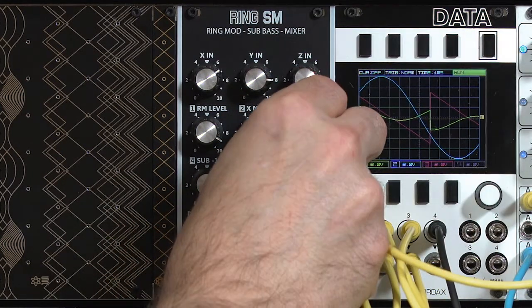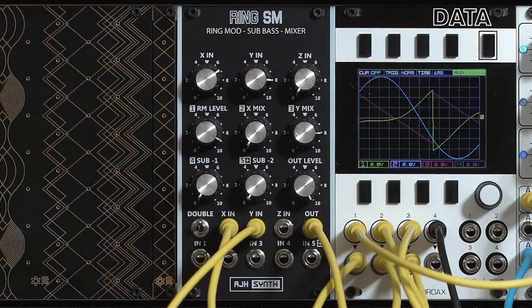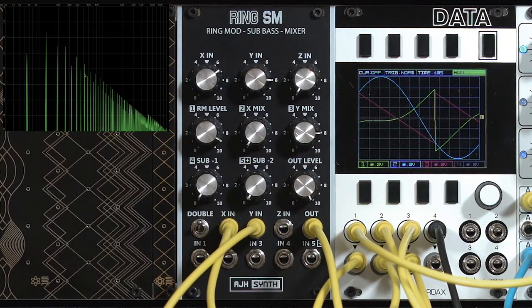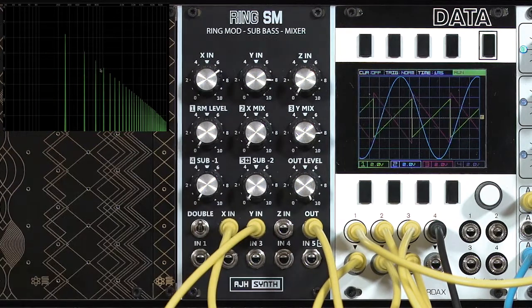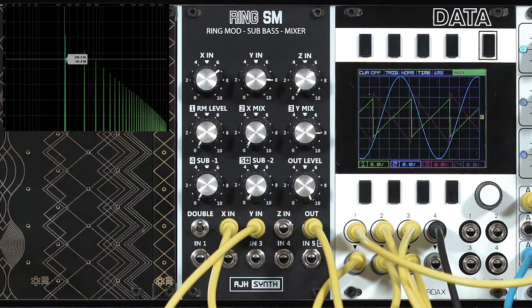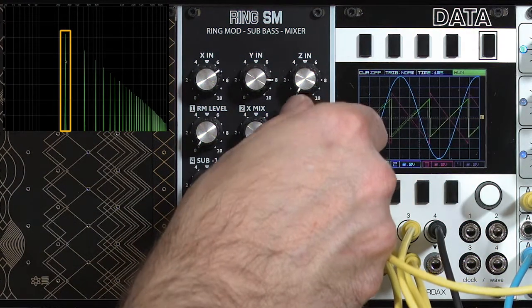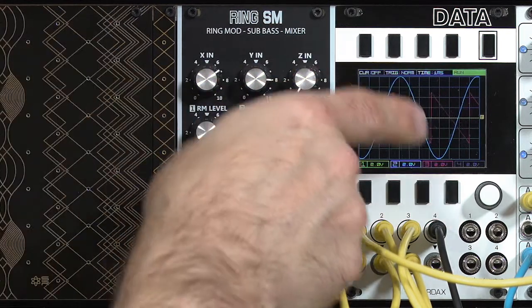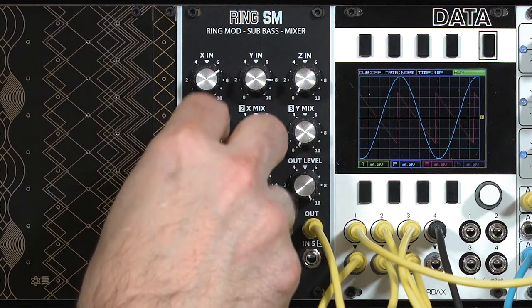So let's look at what the harmonics of the sawtooth by itself look like. I'll bring the Y up in the output, turn it back on again, and play it up an octave so you can see what's going on. Turn off the ring modulator for now. Here's our sawtooth wave with its fundamental harmonic right around 260 hertz. Now I'm going to turn up the ring modulator that has a sine wave at half that frequency, so it should add to and subtract from that fundamental.